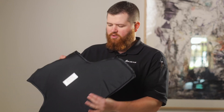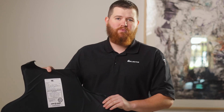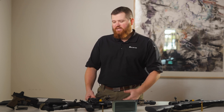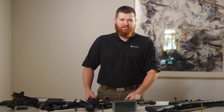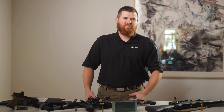For example, everyone is familiar with soft body armor panels — this one's from Armor Express — the kind a police officer might wear. You can use soft materials like Kevlar or fiberglass panels for in-wall protection, which is a lot cheaper than armored steel. UL Level 3 goes all the way up to .44 Magnum and basically covers all the common pistol calibers you might encounter, saving you money while still providing protection against pistols and concealed weapons.